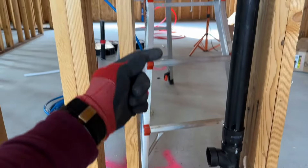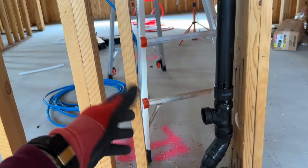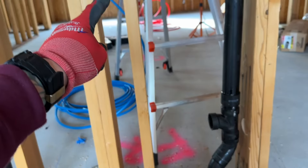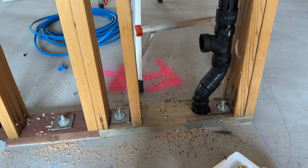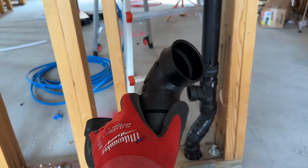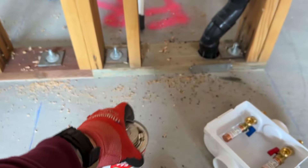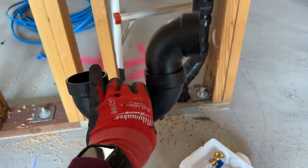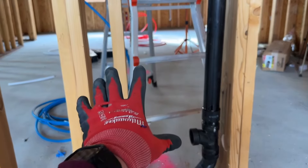You really want that long run — you want at least 24 inches of run. We're going to be over 30, but you want a long straight run down to that P-trap. So let's go ahead and install this P-trap. This is a solvent-welded joint P-trap; I don't want to do anything with union joints that might come loose. So we're going to be using this black ABS cement to cement this in place. We'll get this mounted and then we'll start cutting our pieces and get it all together.